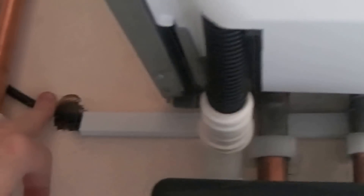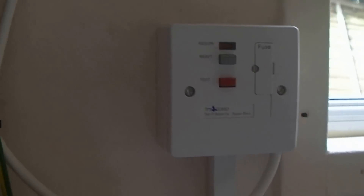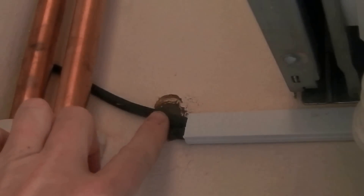That was the FW100 sensor and there's another wire coming through the wall here which was for the FW100 external sensor. I've just run those through some plastic trunking and they exit there. We've got the RCD spur there - this is all heat resistant cable. The polarity does not matter on the FW100 and the external sensor, and the wiring is all done in there, very easily achieved. You just take a few screws out to remove the cover and make the connections.